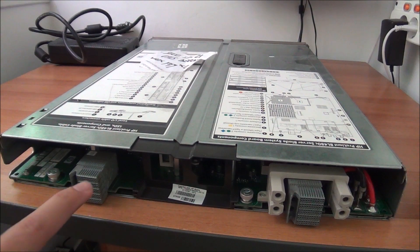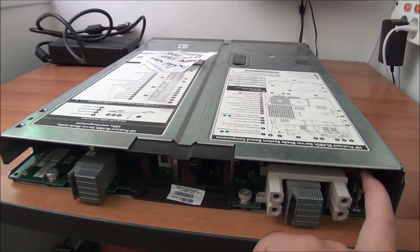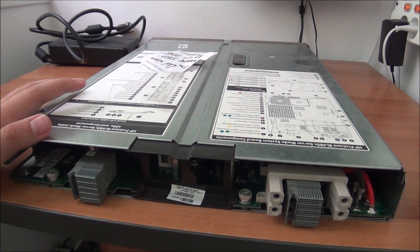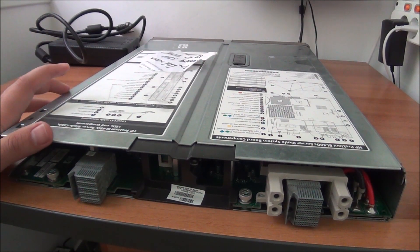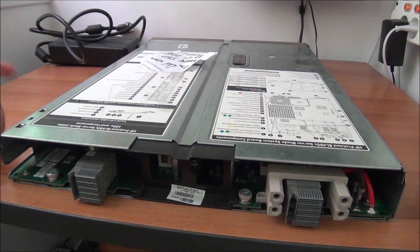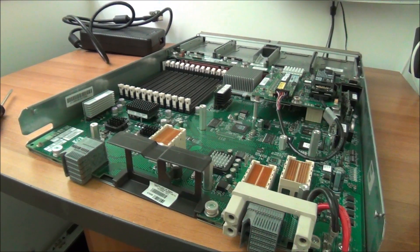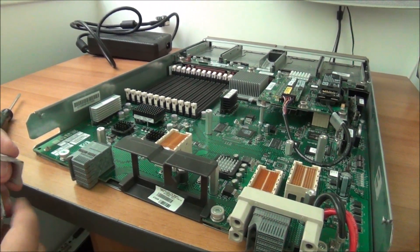This is the back of it — you can see where it would connect to other boards, and here is where it would get its power from through these thick wires. In full configuration with four hard drives, tons of memory, and really powerful CPUs this thing draws a lot of power, but hopefully in my light configuration my PSU will be enough. First thing I need to remove the connectors I won't use and try to solder something directly to these cables.